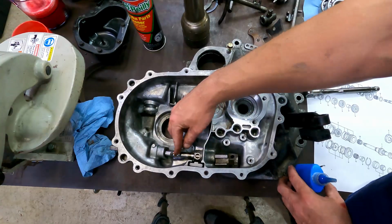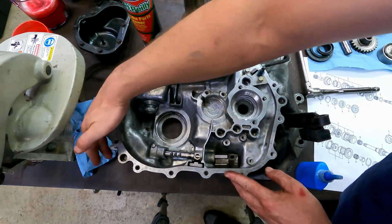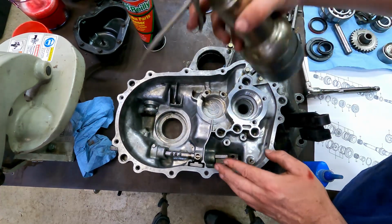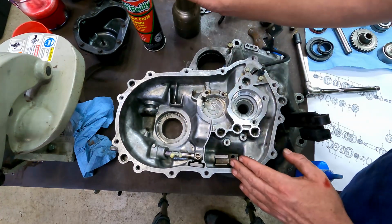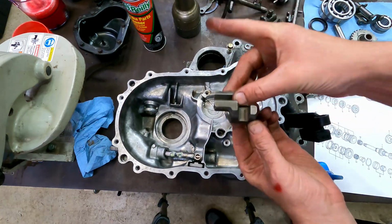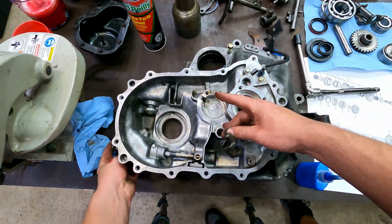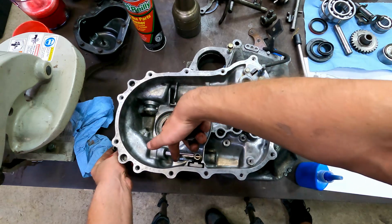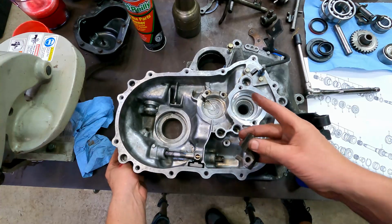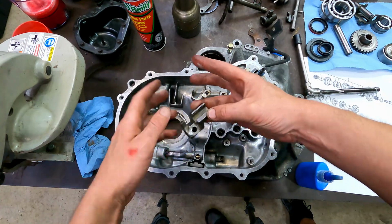Okay, what we've got here are the detent slots for that spring and ball that are down under here, and that shaft that we replaced the seal on that goes here. And we're going to push the whole thing back in, but before we do, it's a good idea to go ahead and put a little lube on those. We've got the piece that we're going to have to bolt back on the rail ready, because it's going to come out here. I want to turn it so that the cutouts are on the bottom. And you can see here, the rail's got that bolt hole ready.